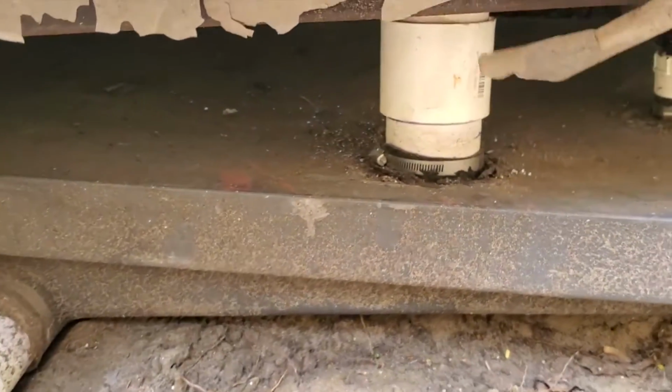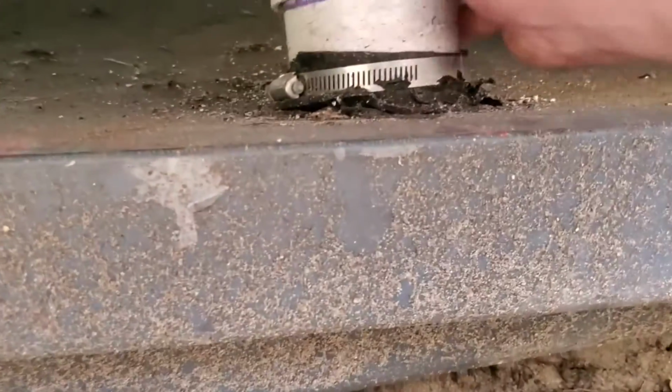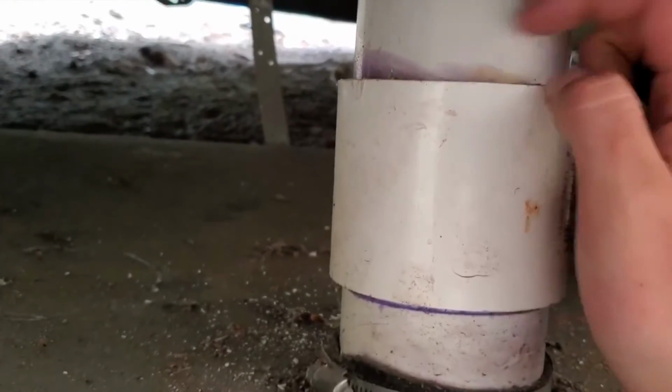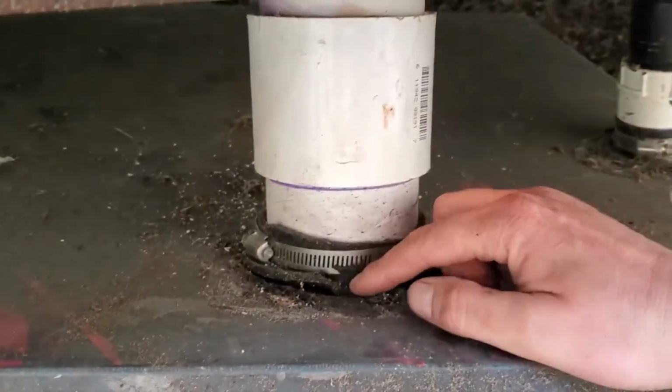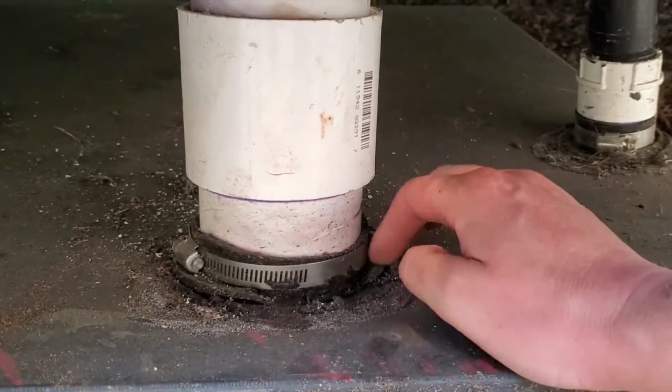The Blackwater tank is dropped. This is the pipe that goes directly vertical to the toilet. I'm gonna get this off of here, or maybe just cut the pipe here to attach a new pipe. Probably just remove it from the tank and replace this gasket, which is a little bit messed up as well.